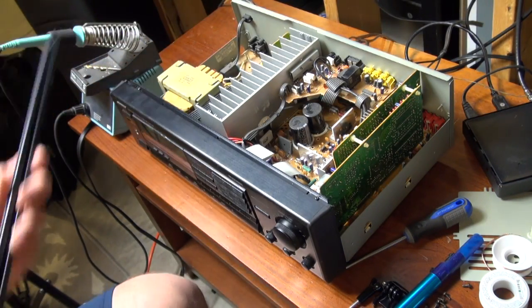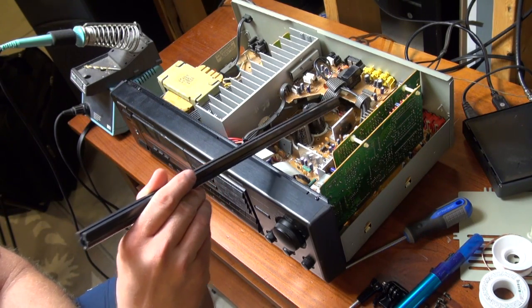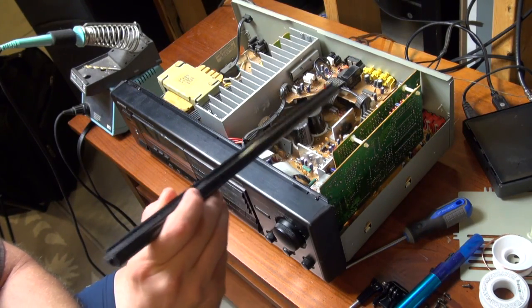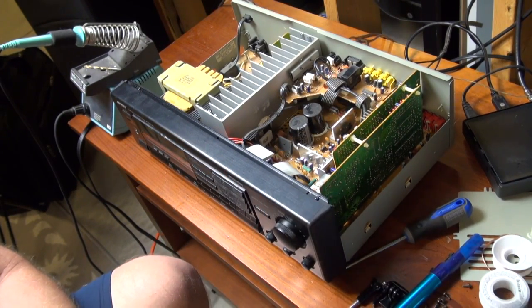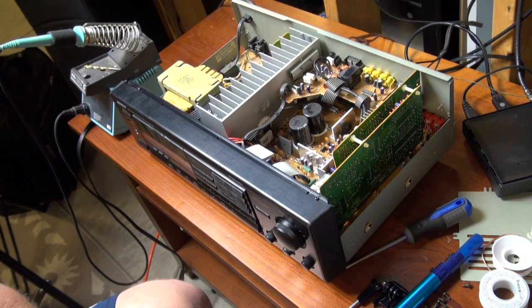And what I have found is that inside of here, you've got a relay that controls the power to the speakers. And if you go in here, it's right underneath this board here, and tap that relay, it actually makes it change, and now the sound's coming out of the right speaker, and it's real staticky on the left speaker. So the relay, it's the type that's sealed. You cannot take it apart and clean it.